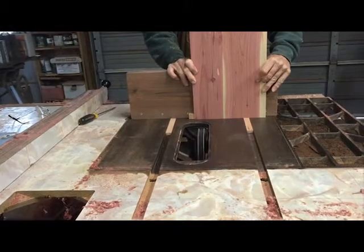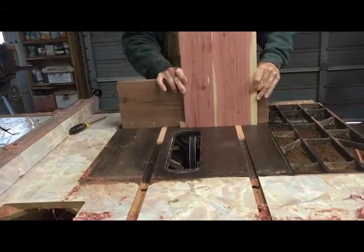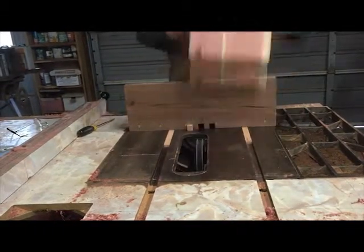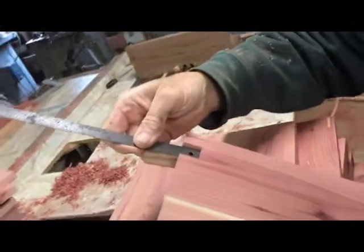All it's holding that is my hands. I mean, you got to have some hand strength. It's going to be kind of important, because if that rides up, your cut's not as deep. All I'm doing now is checking my depth. My depth needs to be the thickness of the lumber, which we've gone for 3/4. Now see, I'm a full 16th too far there, but I understand that.